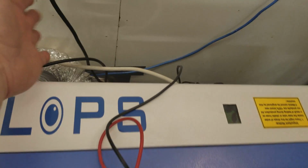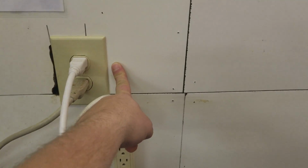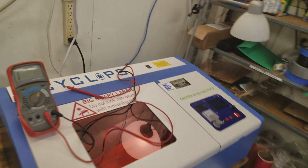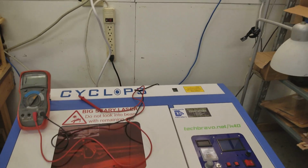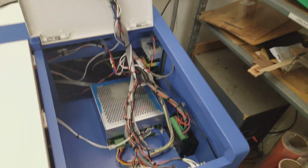Now, the wire in this thing's probably 18 gauge. If you got a 15 amp circuit here, you got 14 AWG Romex. If it's a 20 amp, you got 12. And I believe that solid copper going from the ground bar down to the rod is 4 gauge. If you want to take a little piece of this stuff and run it from that lug, drill a hole through your wall, sit it out there on a piece of pipe and drive it in the ground 1.5 feet, be my guest, useless.